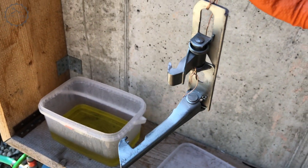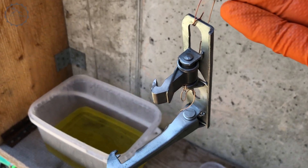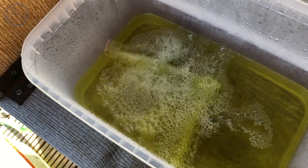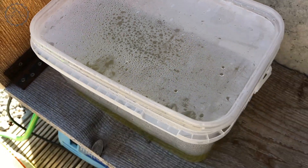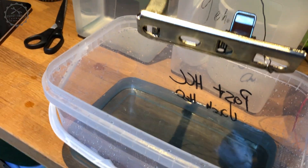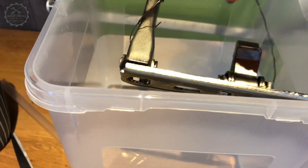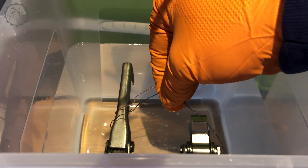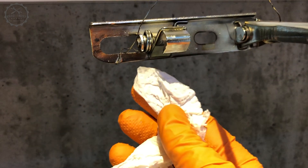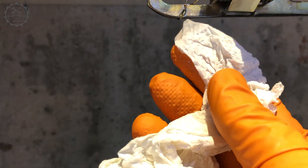Finally, let's talk about assemblies — like this bonnet fastener of the Giulia, consisting of hooks and springs and hinges. As we're using liquids that go into gaps and undercuts, the whole process also works for assemblies. And here's one major advantage of working with HCL: blasting only works if the beads have a chance to hit the surface, whereas HCL reaches everywhere. The rest works exactly like always.